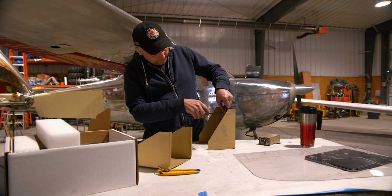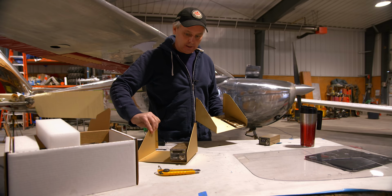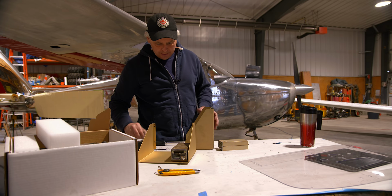And so now that Chris has all of the electrical part done behind the panel, all the new switches and breakers, it's time to start making up the avionics trays and shelves for the back of the Dynon. So these trays go behind each of the panels, and to them, I'm attaching the radio and the transponder and the backup batteries, and then we're going to fit all of that to the test panels, put it in, and just make sure that everything fits and sort of look at the cable runs, what's going to go where and how it's all going to fit together, just as a test.